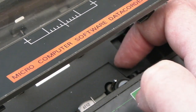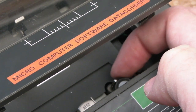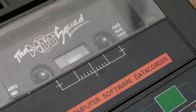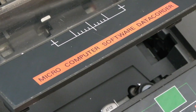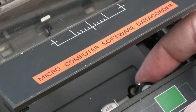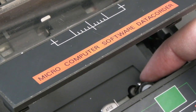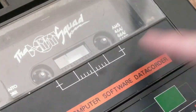I think that's the sign of the belt, but this roller here is smooth. So we'll have to scratch that very gently with some very light sandpaper, but change the belts. But yeah, it's moving now, it's keeping going. I might just go and get my tape, we'll give it a try. So rewind and fast forward's working alright. Let's press play. Yeah, look, it is not working, is it? It's definitely the belt that's the issue.